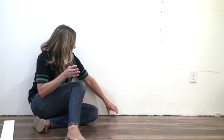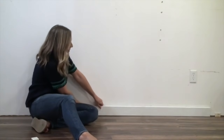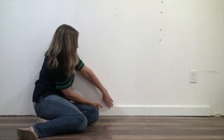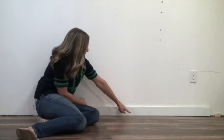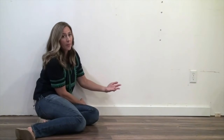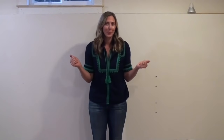First, remove your spacers around the edge, then take either your baseboard or your quarter round and set it right on top of that edge floorboard. If you're doing a new baseboard, nail it right into the wall. If you're doing quarter round, put it at the bottom of your baseboard and nail it into the baseboard. Both of these finish the look, but they also hold the boards in place all the way around the room. Once you've finished installing your baseboard or quarter round, you are done and get to enjoy your beautiful new laminate floor.